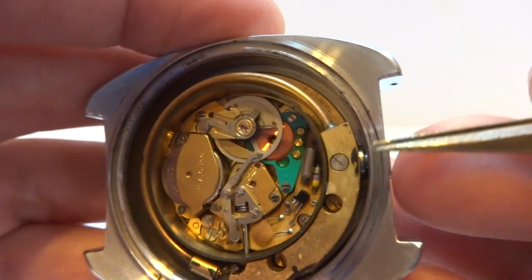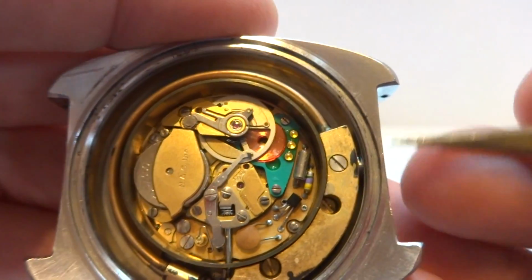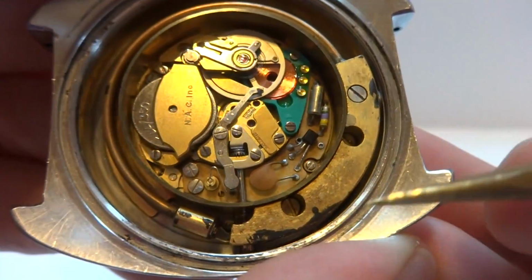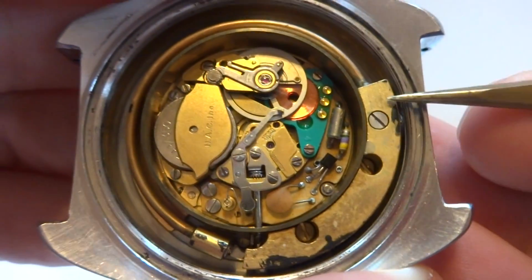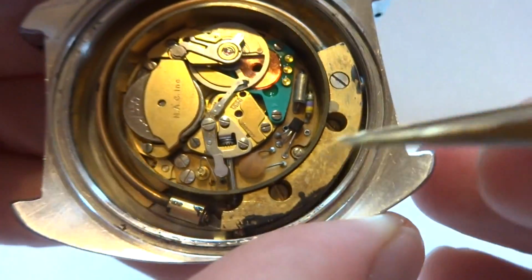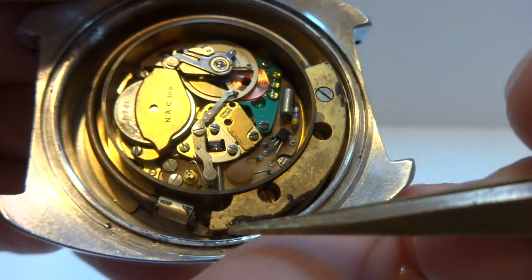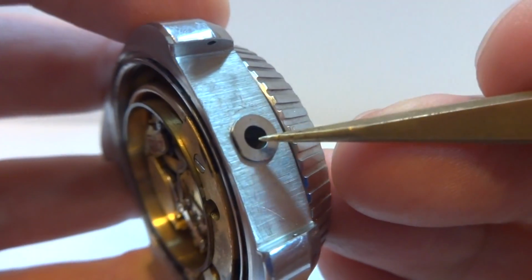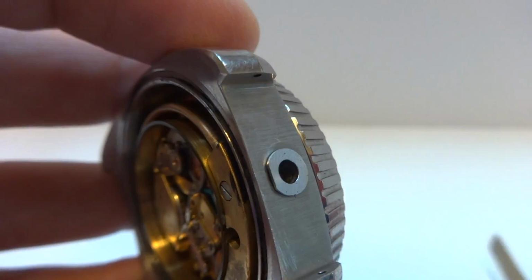I did make sure that the hydraulic fluid was out of the Bourdon tube. Mechanically everything's intact. So the tube's intact. Actually the gasket and the seals are all really good. All of the levers and the pinions are also there. The one thing that's missing is the membrane that would cover the end here.